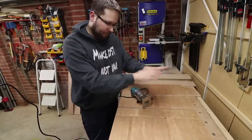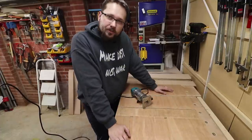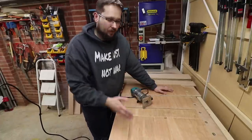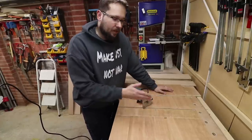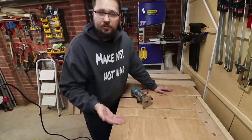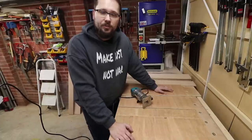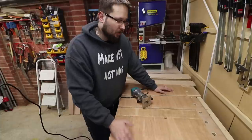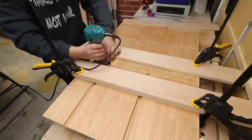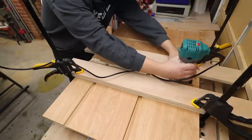In the next step, after the glue is finally dry, I want to make a channel where the blade's going to go. I'm going to try to do a zero clearance insert plate that goes right in there, because sometimes you want to use different types of blades with your jig and you lose the zero clearance made initially. Over time the jig gets damaged, so the zero clearance plate gives us the option to just swap it out — you can use it with different blade types or replace it when it's damaged. I'm going to use my router to do a 5.5mm depth channel, as I have a sheet of plywood that is 5.5mm thick which I'll use for the zero clearance plate strips.